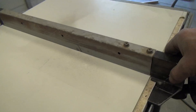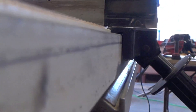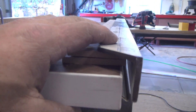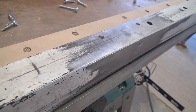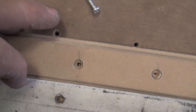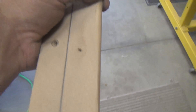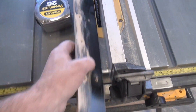I got it over here and it's pretty good - it slides on here. But I think this metal track has to get lifted up about another eighth of an inch to sit in there tight. Now it's upside down. I'm going to add some more screws where the pencil mark is because when I clamp it down it flexes a little, and this will give it some extra strength. The easiest thing I figured out is I put a pencil line where this finger is and here. I took this rail off - the part where my thumb is just has to get cut down. I'll run it on the blade of the table saw and take off about an eighth of an inch, so it sits deeper.